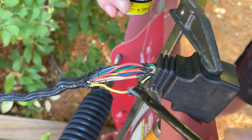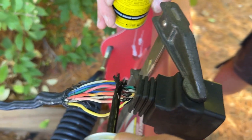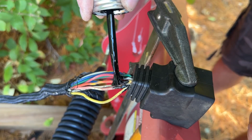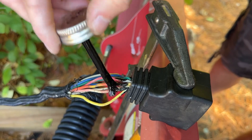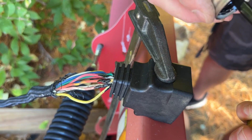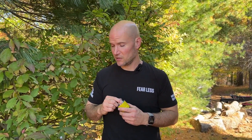It's been about five minutes — we're going to put on coat number two. I flipped the plug around so you guys could see it, and I checked the rest of the wires — it is only these four. It's dry to the touch now, so we can add a little more to each one, going out a little bit past where the damage is. What you want to do is make sure that copper wiring is no longer exposed to the elements, just like the original insulation. I'm going to put two more coats on — I won't bore you with that. It's just rinse and repeat, and then we'll come back and show you what it looks like when it's dry.